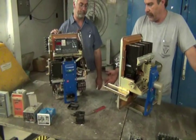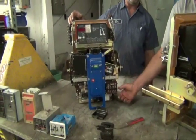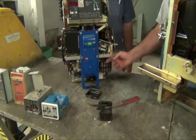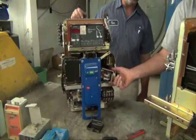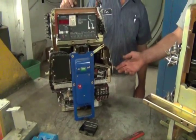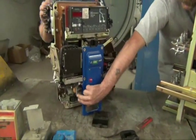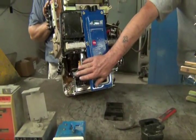Some of the parts that the electric has: it has a relay on it, it has a closing coil. Some of them will have two relays like this one has here. One is your anti-pump, which prevents the breaker from closing after it has tripped out until the relay clears. The other parts are your auxiliaries, your shunt trip bracket which is underneath. Some of them will have UVRs underneath as well.